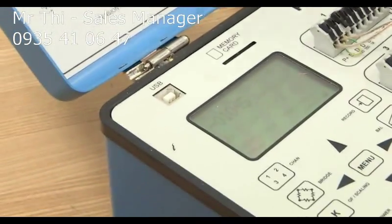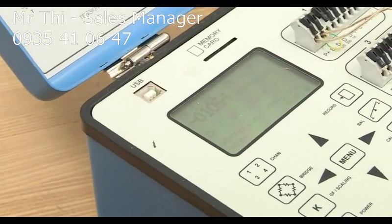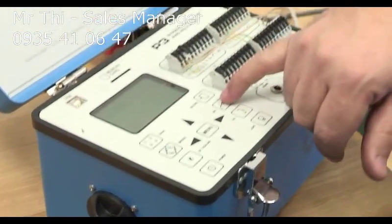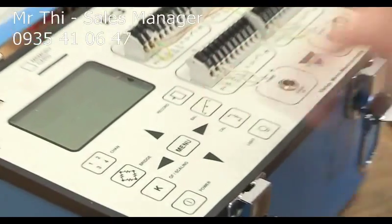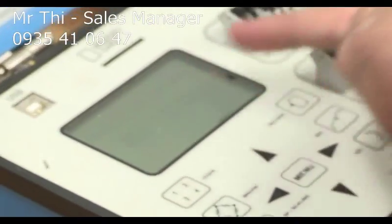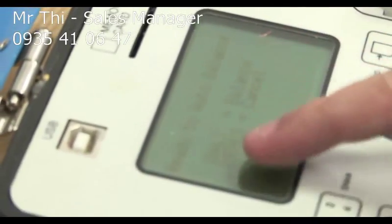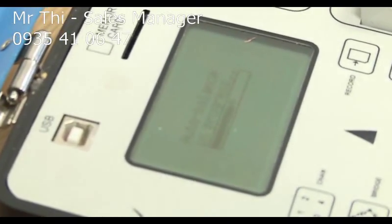And definitely we're not going to start with that. We are going to zero the reading of the strain gauge. And to do that, you click balance. And then it says ready to auto balance. And the answer is yes. If you are ready, you have to click balance again. And then it goes through the 4 channels.